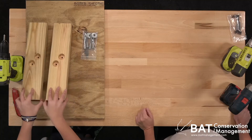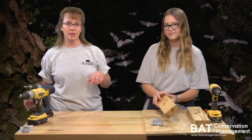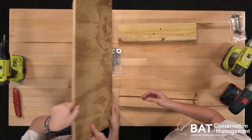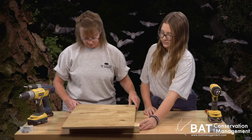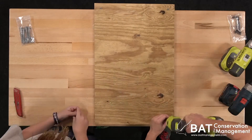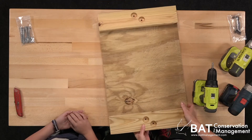The mount kit is an upper and lower mounting bracket, a perch panel, and some hardware. Lay out the brackets face down. Take the perch panel with the roughened side down. Square up one end with one of the brackets and secure with two screws near the corners. Repeat for the other mounting bracket. Now the mounting bracket is ready to install on a post or building using either lag bolts or outdoor deck screws depending on your kit.